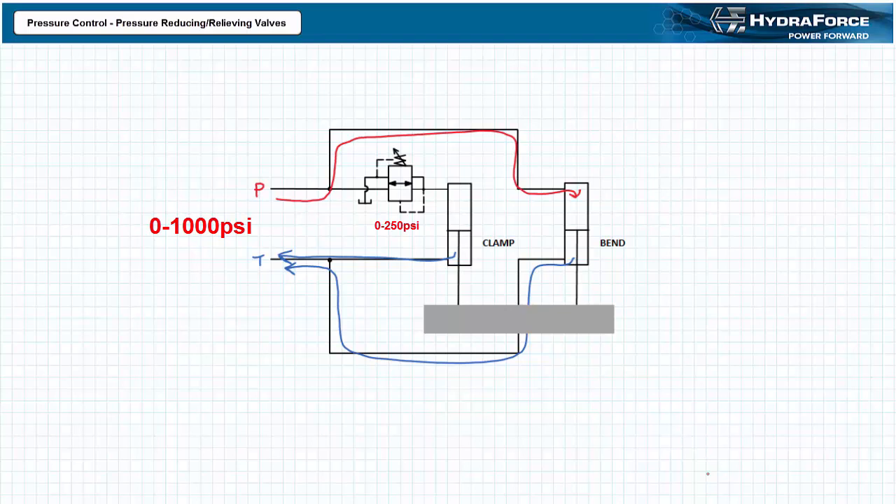Pressure in the bending cylinder, however, continues to rise until sufficient pressure induced force is generated to bend the workpiece. Let's say the act of bending the workpiece to completion necessitates a pressure of 800 psi. Pressure in the clamping cylinder's cap end is still limited to 250 psi by the pressure reducing relieving valve. If the bending cylinder reaches the limits of travel or the workpiece stalls the cylinder, pressure in the bending cylinder will rise to 1000 psi, the setting of the main pressure relief valve. However, pressure in the clamping cylinder would still be limited to 250 psi. In addition to limiting pressure, the pressure reducing relieving valve also maintains pressure at a preset value. If some outside force exerts itself on the workpiece pushing it upwards, fluid trapped in the cap end of the clamping cylinder would experience pressure intensification above the preset 250 psi. In that event, the relieving function of the pressure reducing relieving valve diverts a quantity of fluid to tank, thus preventing pressure from rising above the desired preset value.